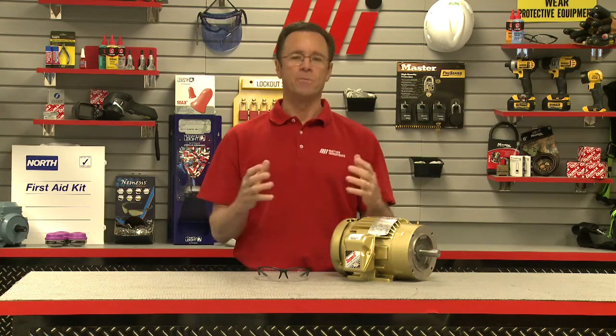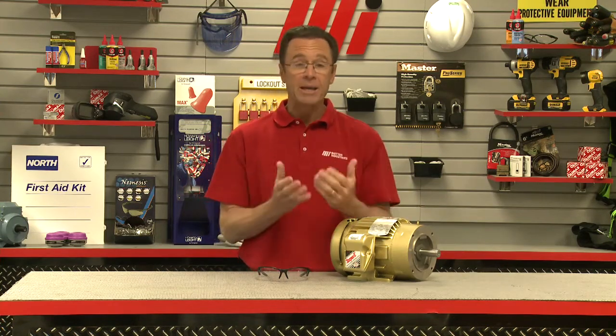Now as a motor user you may be familiar with this topic, and it's been around for as long as the electric motor, but we want to examine this a little closer to see what it's really telling us. NEMA, the National Electrical Manufacturers Association, states by definition and I quote: the service factor of an AC motor is a multiplier which, when applied to the rated horsepower, indicates a permissible horsepower loading which may be carried under the conditions specified.